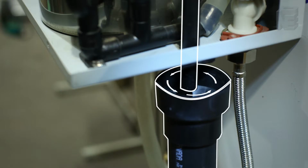There must be an air gap between the 1/2-inch outlet and the rigid drain piping. Thus, the larger drain pipe fits over the smaller 1/2-inch outlet and is supported. The drain is by gravity siphon, and there must be an opening where air can escape as it is displaced by the water siphoning out. Do not sweat or clamp any piping to this 1/2-inch outlet.